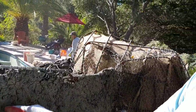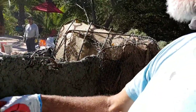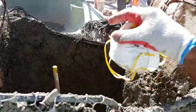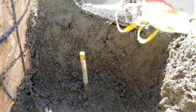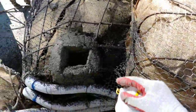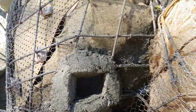We did our pre-pour of this back wall, so this thing's all solid. It was just a single thickness of rebar and chicken wire on both sides. We pre-poured it and now we're safe. Same thing with the dam wall over here on the front of the grotto. This is gonna be the pond that starts the whole waterfall - it's gonna well up here and then spill over the edge and go out into the pool. I like the pre-pour approach. Made another window in it over here so that'll give some light and air so it'll breathe a little bit.